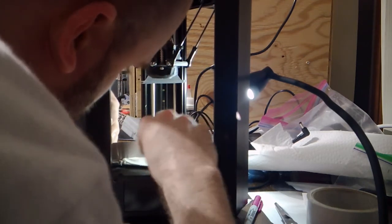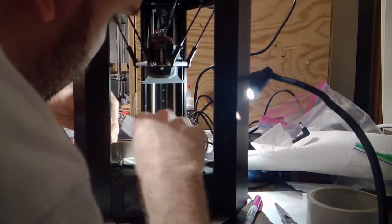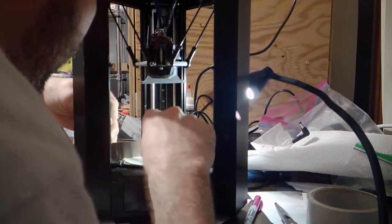So let's, just to be sure, check this last tower. Let's just push it up against the rail, slowly lower it. Yeah, I can still see from the light that it's touching the build plate on the outside. And let's see if I can slide an index card through. So when I tested it before starting this video, I could. So now I'm just barely touching. Oh, that index card's lifting up. So yeah, when I go to a flat index card, I can definitely feel something under here.